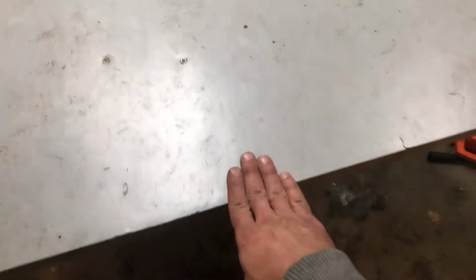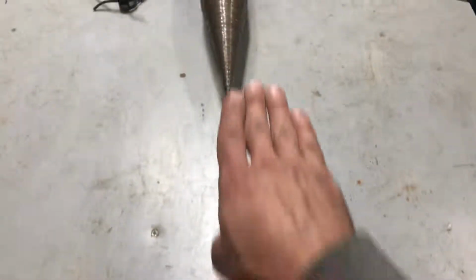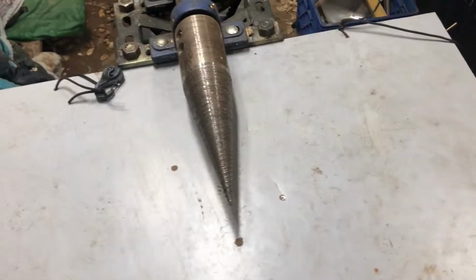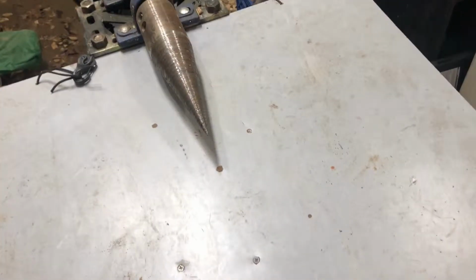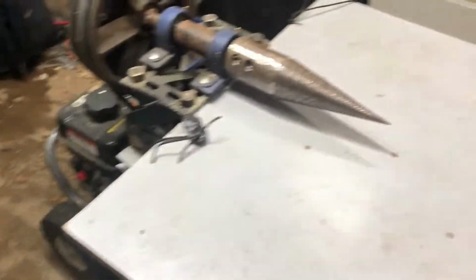I have a 1x6 that I set right here, and I'll put it up against my hip. It sits up against the base of the log. I can hold the top of the log and lean forward with my hip, so when it starts to suck in there, if something happened or if the log moved out of the way, I don't fall into the screw. This little 1x6 would just slide and no problems. But those are the things I did to try to make myself safe.